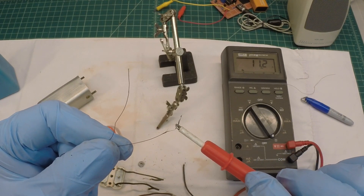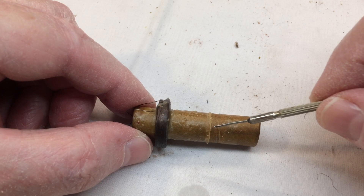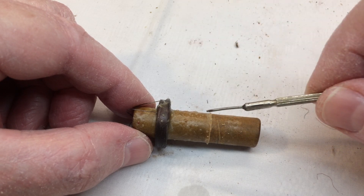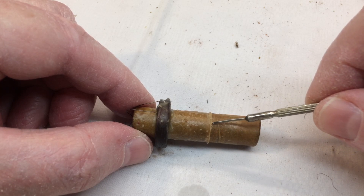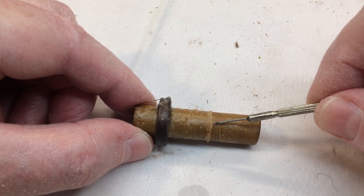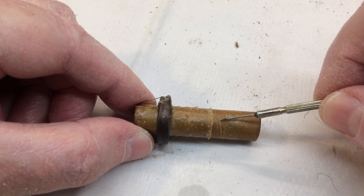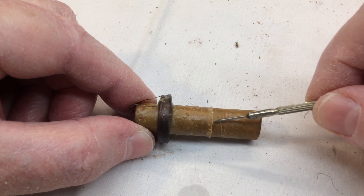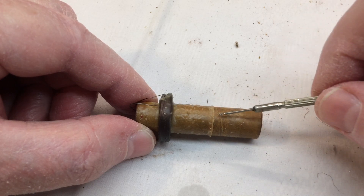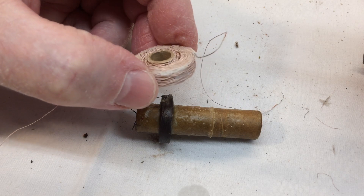Assuming the DC resistance of the primary and secondary coils are similar, the coupling between primary and secondary is important. I'm going to use one of my coils that I've already wound, pull a few windings off — it measured about 1.6 mH — and cut the coil at this location, using epoxy to place it back on. This will be my cut location, which is about 18mm down from the edge of the form, or about 22mm from the center of the coil back. My replacement coil is here; we'll see how well it works once we get it back in the receiver.